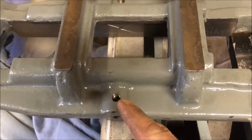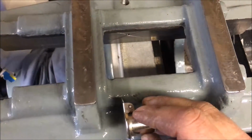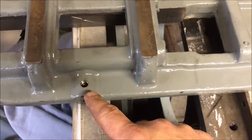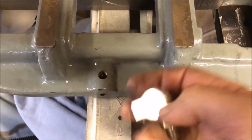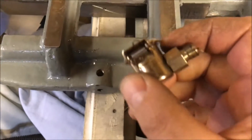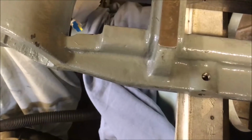Right, so that's the point at which the oil cup's got to fit in. That's my side mounting oil cup, which would screw in, apart from the fact it won't rotate. Fairly sure I got the dimensions right. Anyway, long and the short of it, I've got to make a plug that will fit in that male, come up, open out, and have a BSP female I can screw that into, so then that'll get over that problem. Would have been nice if that thing would have just rotated. It's a 3/4 inch diameter plug, pot. Maybe 1/2 inch would have been better, I don't know.